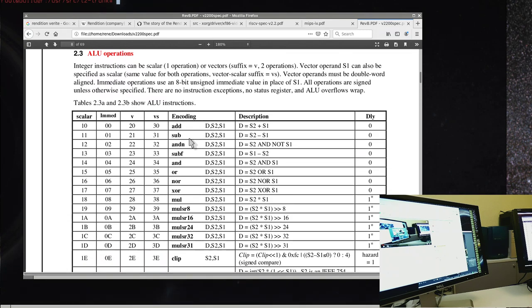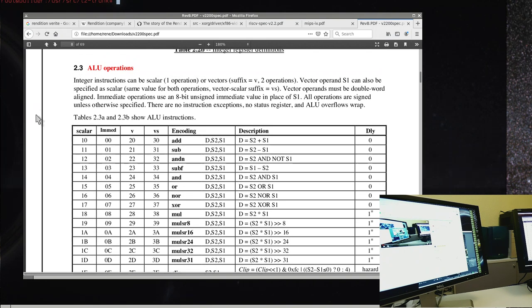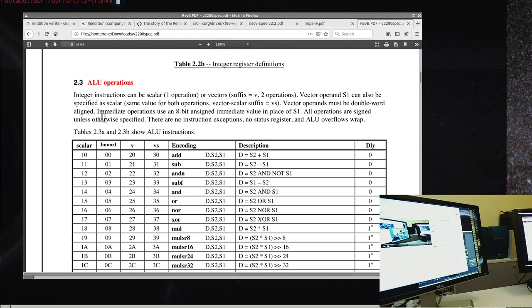And here comes the instruction. So this GPU really runs regular add, subtract, and so on. And I show you this also, so that you see how this is built up, similar to RISC-V and MIPS, so that you understand how GPUs or CPUs really work. And what is interesting is that they have these instructions multiple times. So this is from 1996 or so, in the mid 90s, or they certainly started designing this in 1992, 1993, 1994, something like that. Then maybe 2 years to market or something.